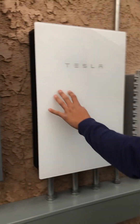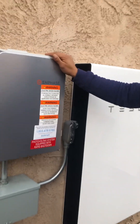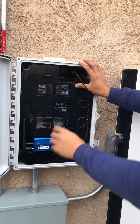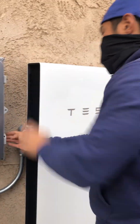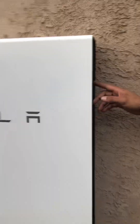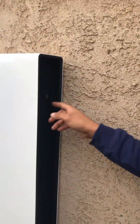This is your gateway — that 70-amp breaker labeled 'gateway' is the first point of interconnection, so without this none of these would work. This is your solar combiner box, which hooks up to all the panels on the roof. This is what powers the box and a certain amount of panels, so you want to keep these on at all times. Right here is your battery — you guys finally received it. To turn it on, come to the side, flip the switch to the on position, the green light turns on, and you're good. We're going to leave that in the off position for now.